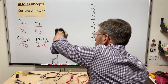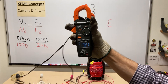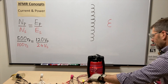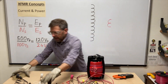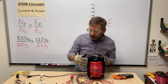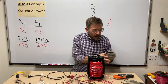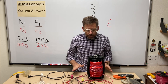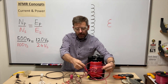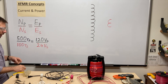The primary had two amps flowing when there was no load on the secondary, but with 75 amps on the secondary, we have just over 17 amps on the primary. Let's unplug this pretty quick — the amperage was starting to drop on the secondary because it's getting hot. I'm running it well above its power rating. We had about 75 amps on the secondary (the red wire) and about 17 on the primary.